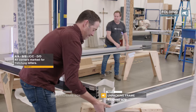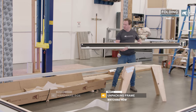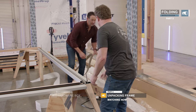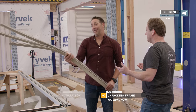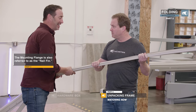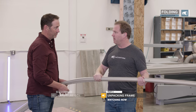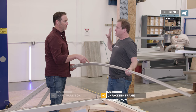You can lay them flat now because we have to pre-drill them first before we stand them up and join them. These get thrown away all the time too — these are nail fins. You're going to need them for the installation. They go in the side jams and the head of your frame and integrate into the weatherproof barrier of the home. After install, when we join it, we're going to put these in and stand it up with the nail fin in.